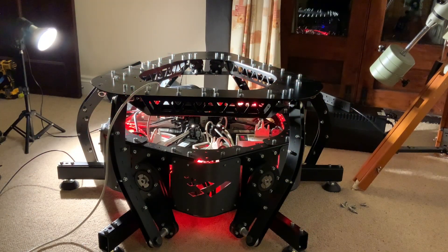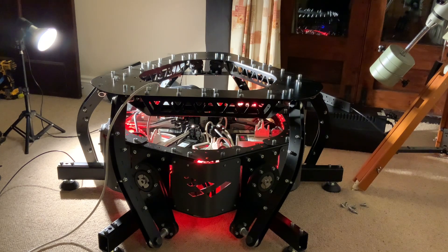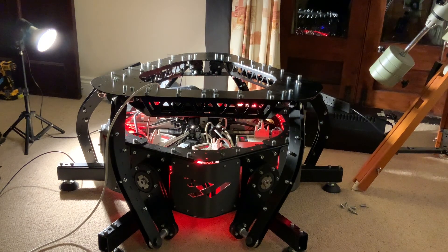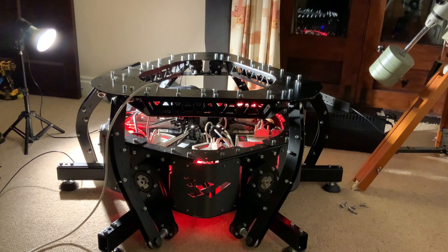After making all those changes, I focused my attention on learning how the controls work and motion simulation. I ran into a problem which is actually apparent in my last video, though it didn't occur to me at the time. As I was using the system more, it became obvious that I was getting disconnection issues between the motion rig and my computer via the USB cable. Troubleshooting thoughts included earthing faults, poor connections, or too long an extension lead losing signal. What was happening was the motion platform was visible to the PC and dashboard application, but it was disconnecting approximately every 10 seconds.